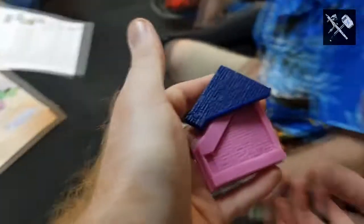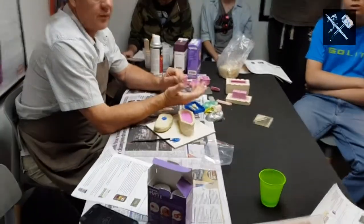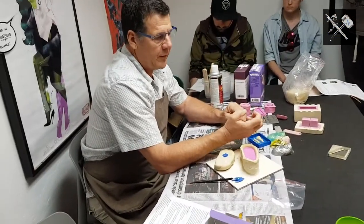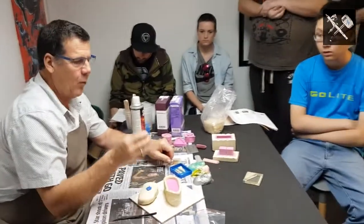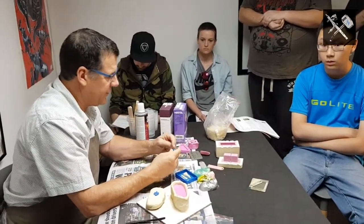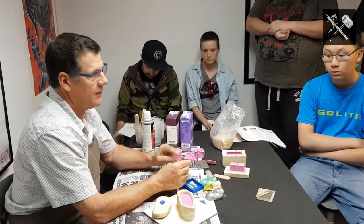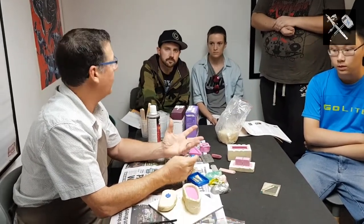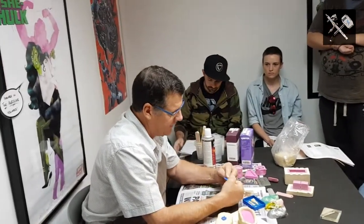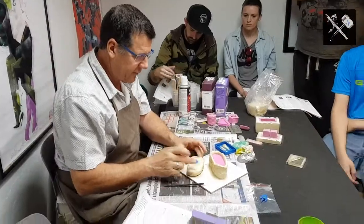So the effort you put into, and that's the resin reproduction, sanding, filing, polishing, finishing your final product before you take the silicone mould off it, because whatever you've left on your master will be picked up in that silicone. So if you've got little scratches, dents, chips, every casting you do out of that silicone will have that same scratch, dent, chip. Now, in what you're doing, you don't want that, so put the effort into the master right up front. Even if it takes an hour to sand it, file it, smooth it, put that effort in at the start, all right? So I've set that down in there.